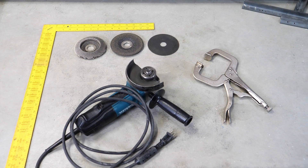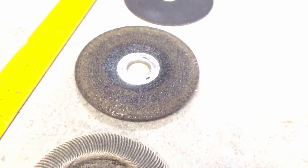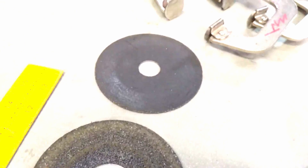For the tools you're gonna need to weld this up, the first option is the traditional approach: a speed square or carpenter square, some clamps, some angle iron scrap, and some extra steel pieces — you can just use the frame itself. You're also going to need an angle grinder with up to three different disc types: a cutting wheel, a flap wheel which is like a sanding disc, and a grinding wheel to dig down through welds quickly. I'll put links to all the tools I use down below.